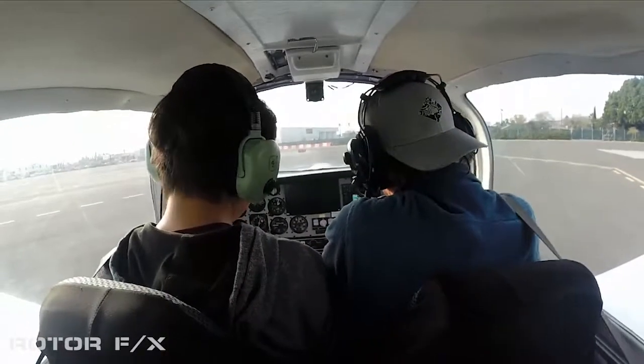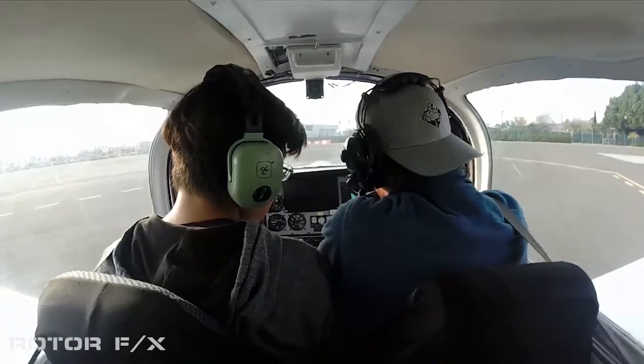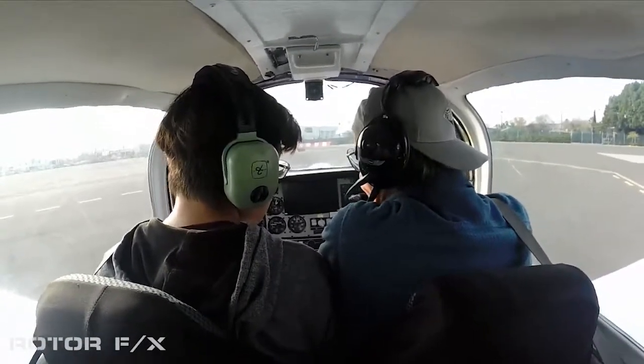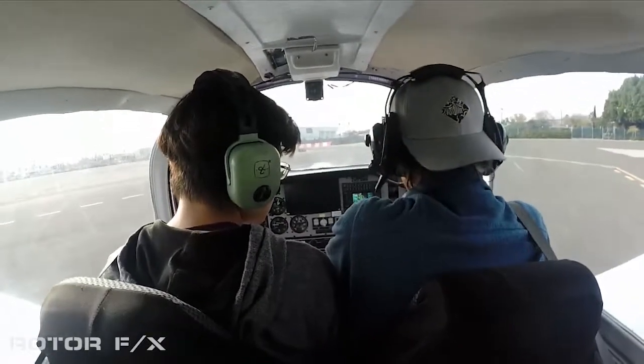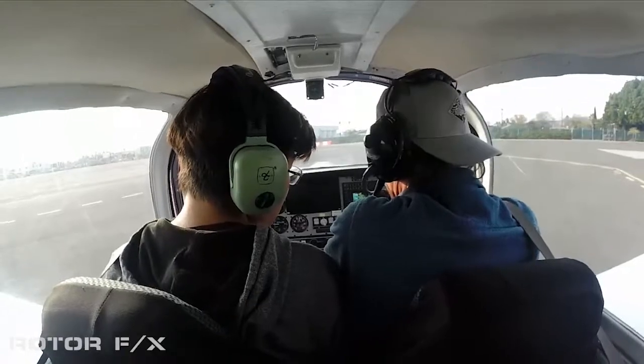Now we're going to check our engine instruments. Our fuel pressure is good, oil pressure is good, our battery is charging. This is stuck here, but I reported it. A sensor is broken, they're going to fix it. We know the engine is cold because I touched it before, right? No problem. Our vacuum is good. Our exhaust gas temperature is good. Our hour meter is working.